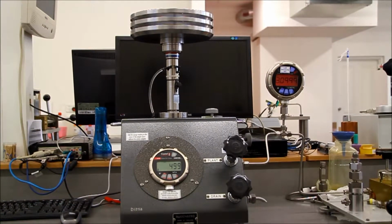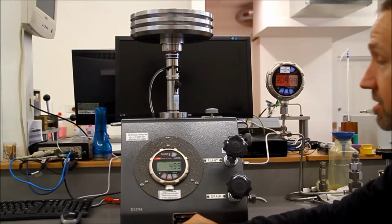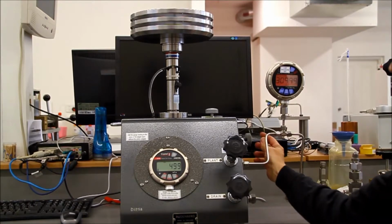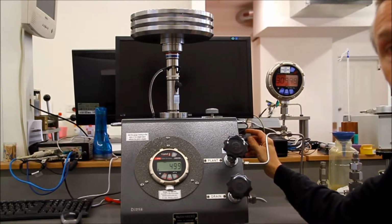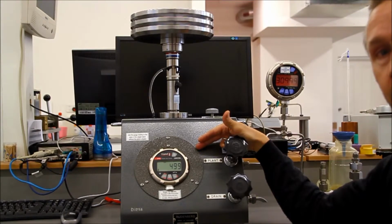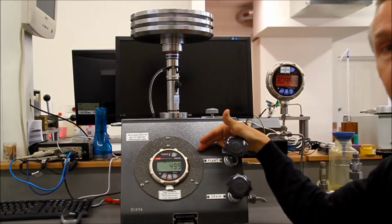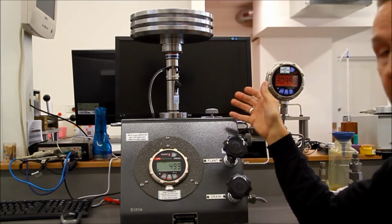So we hope in that video to have shown that the operation of the crystal digital tester gauge in this circuit is simple and easy to operate. We find that the volume you need to wind in with the screw press is much smaller than that you would use with a mechanical pressure gauge, which makes it easier to operate. But it also makes it much more robust, because this instrument is much less vulnerable to any damage from being overpressed, which is a common complaint and a problem in the industry, or zero shifting of the gauge through the gauge having been transported.